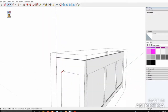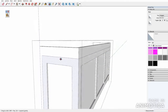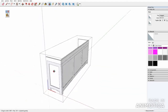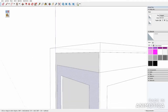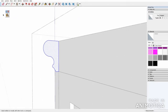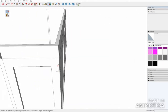I'm going to use the Follow Me tool here in a minute, so I want to have a line, this path drawn in the component. Pretty much just take that line all the way across and around, and that's the height of my chair rail. Chair rail is not a sprung molding, so it's just the flat height and perspective. Now I have gone ahead and drawn the line art of this, and just quickly I'll show you. If you have to make this from scratch, you can do that pretty easily.